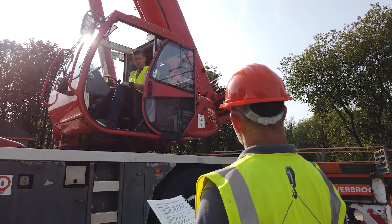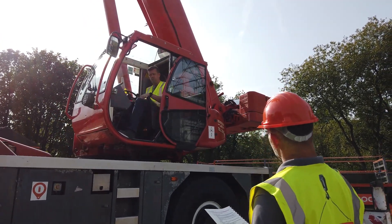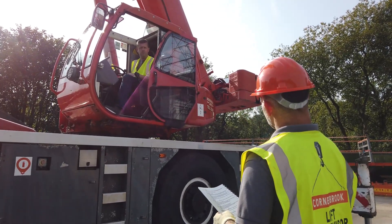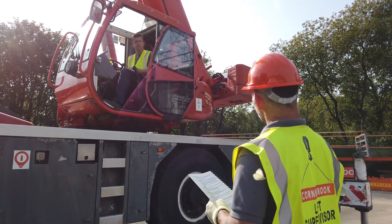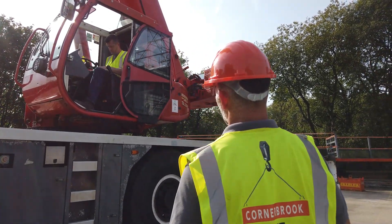Can I confirm your crane's set up to manufacturer spec? Yes. Can I confirm your boom to the 26.8 metres? Yes. Okay, RCI's set? Yes. And you're happy with the machine and the weather? All good. Okay, Matt's now going to sling the load — can you just follow the signals from Matt please?